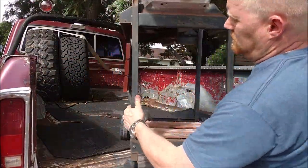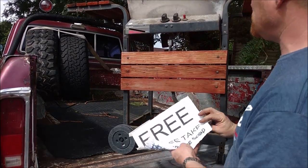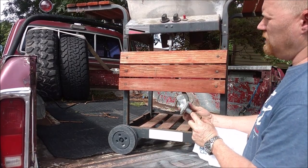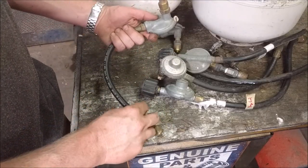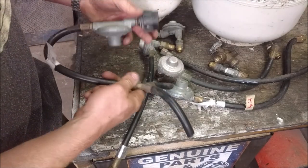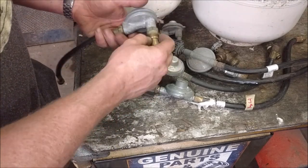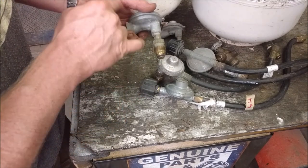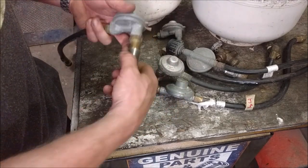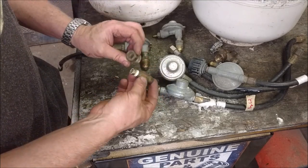Now that we've got a free barbecue home, there's really only one thing we need off of it — this little fitting right here. I have a nice collection because this is how you get them: right off a barbecue. If I see a barbecue sitting in a dumpster, I'll just go up, take my pocket knife, slice the lines, and throw the fitting in the trunk. You can also reuse these regulators if yours ever goes bad. What you're looking for is one with threads — right down here is just quarter NPT, the exact same thread as on an air fitting.